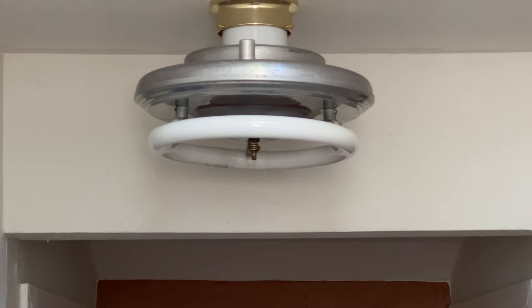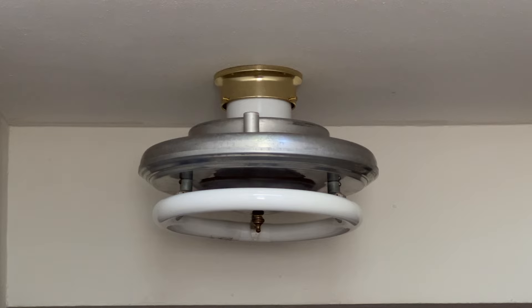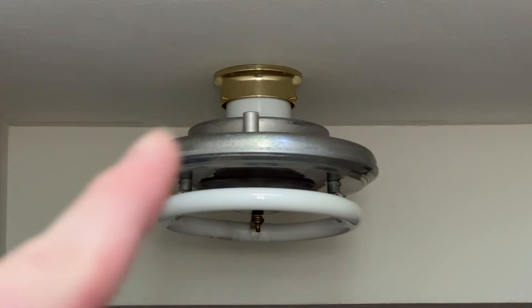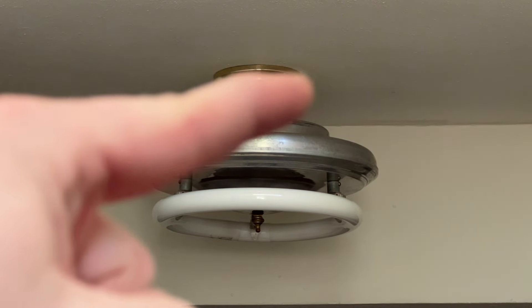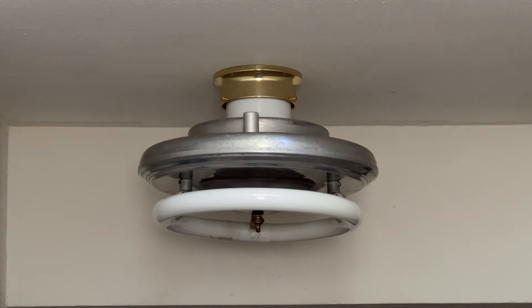So let's go ahead and zoom in on it here a little bit. We'll adjust the camera to get a better view. As you can see, this adapter for the fluorescent fixture just fits on a standard globe fitting — but it's not a regular globe fitting you might find nowadays. This is a 4-inch globe fitting, which was much more common back in the day when this thing was produced. So the idea is that you would take off your big globe, take out your incandescent bulb, install a plug adapter into the socket, and plug this adapter into it, then install the adapter like you would a globe. It literally just sits up in there and you tighten it down with the little tightening bolts. And there you go — now you have a whole different fixture.